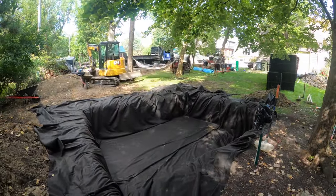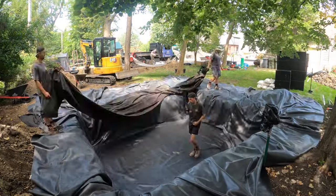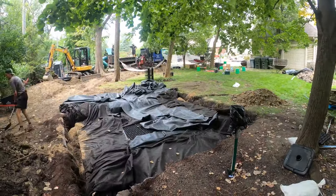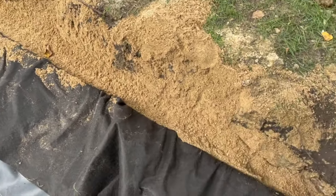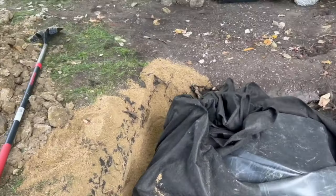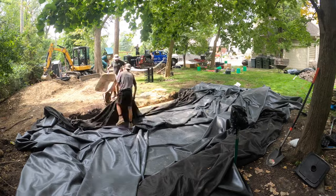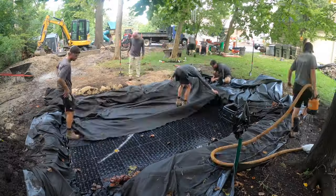Sanding off the bottom, getting everything prepped. We get our fabric in, we get our liner in, and then another layer of fabric over the top of that. We pull out some of the wrinkles and then start getting the aqua blocks in. We pull back all the liner and backfill with sand. The main reason we like to backfill with sand is to reduce the hydrostatic pressure, so that groundwater won't push or heave our tank up out of the ground. Instead, water takes the path of least resistance and pushes up through that sand vein, eventually percolating back into the ground. We always backfill with sand around these larger tanks — it really locks all those aqua blocks together.